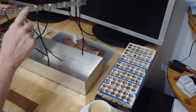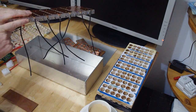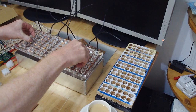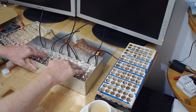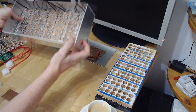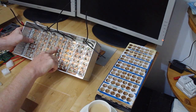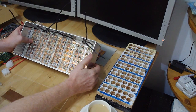And this one here, I kind of soldered it by cutting the overlapping copper and then rolling it around the cable and soldering it with a soldering iron. So it gave the aluminum box a little bit extra space so that this one will fit in here. And of course I will have to drill holes around the edges, this side, and that side, and drill into the plexiglass to hold this stuff here in place. And I don't want to glue anything, I will just hold it with several screws going all the way around.